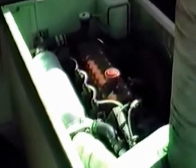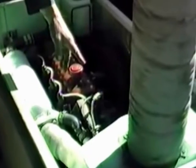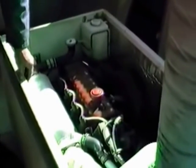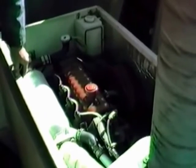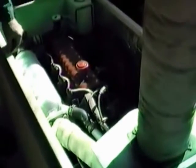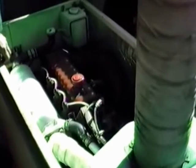The engine is a Perkins Diesel. It's freshwater cooled, water cooled manifold. The freshwater cooling is with a keel cooler, cupronickel keel cooler outside the hull, and that's the only through-hull fitting below the waterline. The transmission is an aluminum Power Glide, a General Motors product, and it's been modified. And it operates off of engine oil pressure with a selector valve operated at the control station.